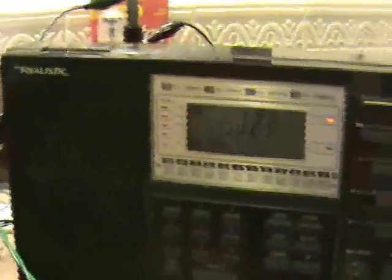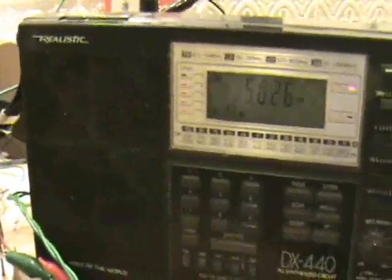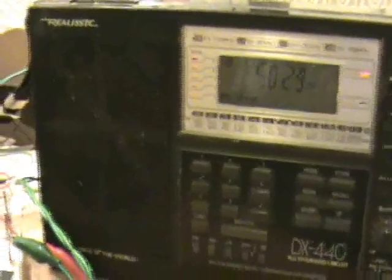Now if you look at the signal strength, right around here, with this weird sort of atmospheric sound, I get the highest signal. The observation that can be made is that this coil-capacitor arrangement offers a very high Q, which is very good for an antenna.